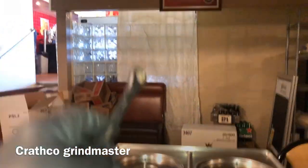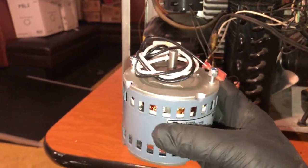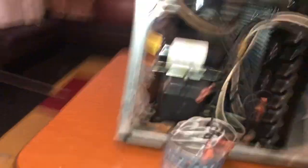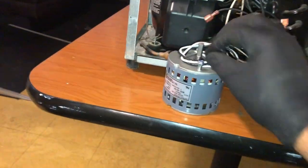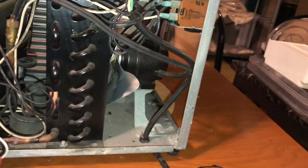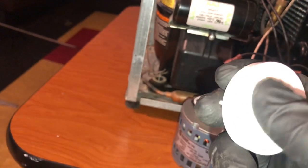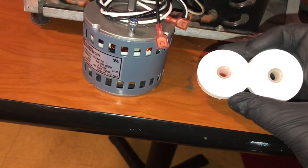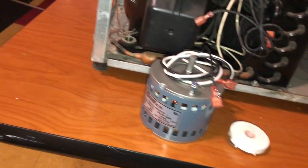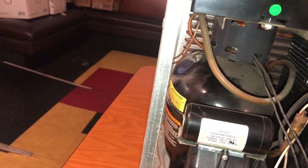Welcome to the bonus coverage. Ever wondered on the horchata machines — you know, the drinks spinning around on top — how to change the drive motor? I'll show you. This is the replacement motor; it bolts in on top. You take all the covers off — it takes the whole plate out with the motor. There's a magnet that goes on with a set screw right on the shaft, and then the top piece is also a magnet — they call it a bearing — that sits on top with your impeller. These wear out quite a bit; once you see that indentation inside, you know they're worn out.